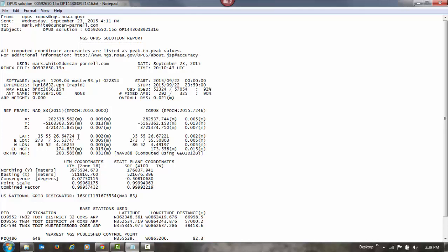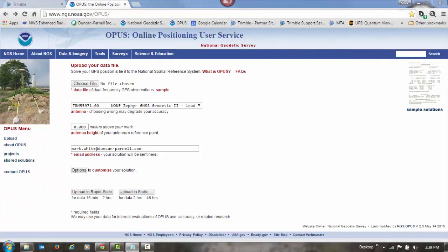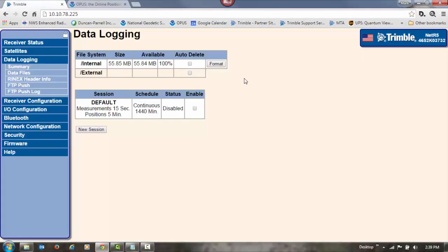So these are the values that we're going to use. We're going to use under the NAD83 2011, not the IGS08, but NAD83 2011, we're going to plug this latitude and the west longitude into our base station, and we're also going to plug the ellipsoid height in there. So what you would want to do is get all 3 to 5, however many Opus sessions you did, take those and average those positions. They should be very close again. You should average those positions, and then we'll use those average coordinates to put into our base station. So I'm going to move that out of the way and go back to my base station where we left off